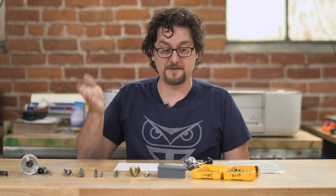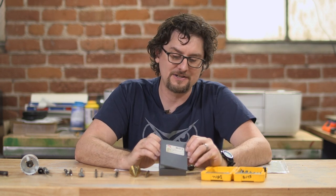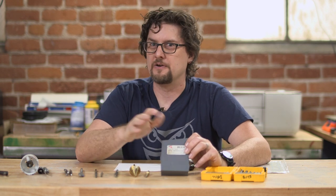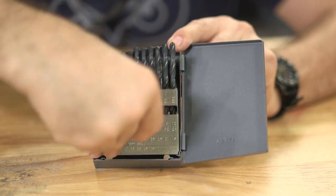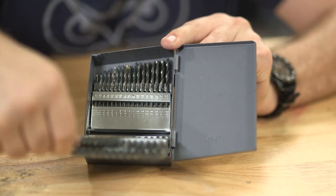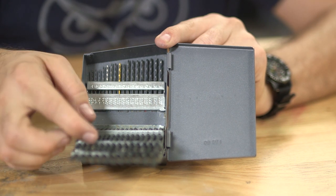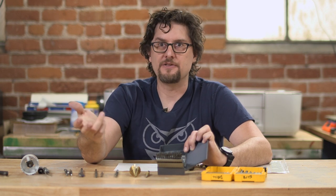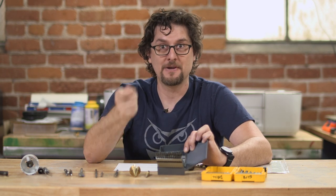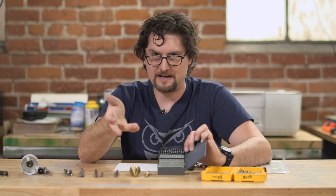Then you're going to have different drill bits and cutting mechanisms for different types of materials. One of my specialized ones that I like a lot are the wire gauge bits. We have the fractional standard bits, but the wire gauges generally run from one to 60 for a general set, such as the one I have here. They do go up as far as 80, which gets into really tiny drill bits — when talking about gauges, the higher the number, the smaller the diameter. I am generally using these for tapping. You'll have a tap chart that, if you want to put threads into something, will say to start the hole use a number 53 drill bit, and that will size the hole properly for the threads of the tap to cut into properly.